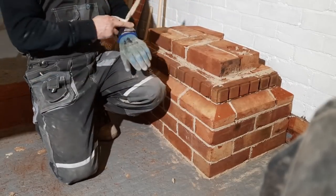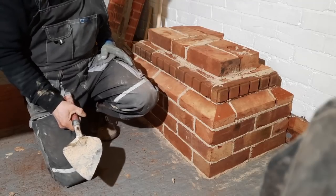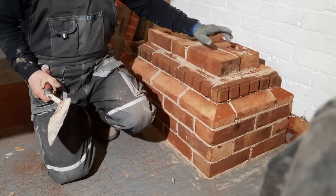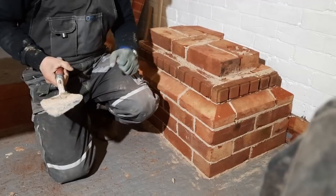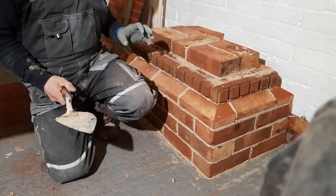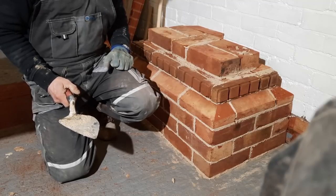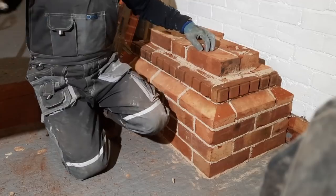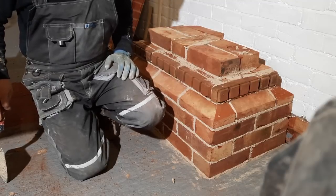I'm getting a little bit late, so 20 past five. I'll get these plinths round and then I'll probably mix up ready for tomorrow. I'm finding, as I always have done really, if you mix up lime mortar the day before and keep it a little bit saturated, some water over it, and then the next day tip the water off and pull it back through the mixer, it mixes up really nice. A fresh lime mix I find has a kind of gritty, dead texture to it, which is really unusual. But like I said, mix up the day before. The stuff I'm using here, I mixed up the last time I was here, a week ago, and I just put it through the mixer again, and it's come up really nice.